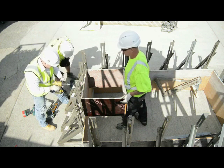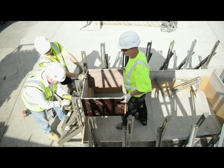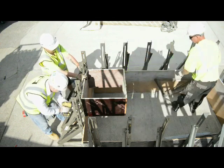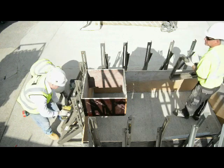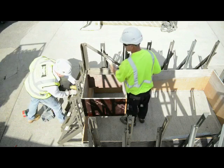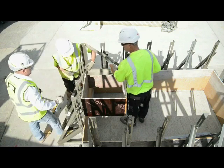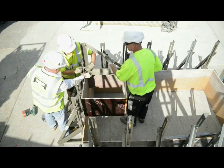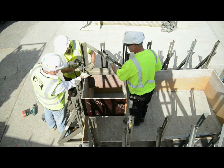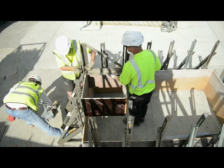And the idea being that you can obviously, instead of doing it in two pours as you may do traditionally, or with a huge timber structure trying to hold the plinth box in place, a couple of our brackets bolted to each other will do the same job, and it will enable you to do the pour in one. So our brackets are all designed so they can be bolted to each other. So it's very straightforward to create plinths, kickers. You can even cast slabs and bunds with walls at the end. We can cast a slab with a wall up to about 1 metre high.